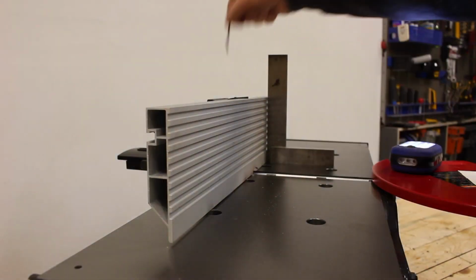I'm good. The last step of our process is probably the most important one, getting our tables dialed in just perfectly. We need to make both of the tables parallel and flat to each other, as well as set them at the perfect height so we can get nice square cuts. Let's check out a little graphic here so you can see exactly what we're aiming for.